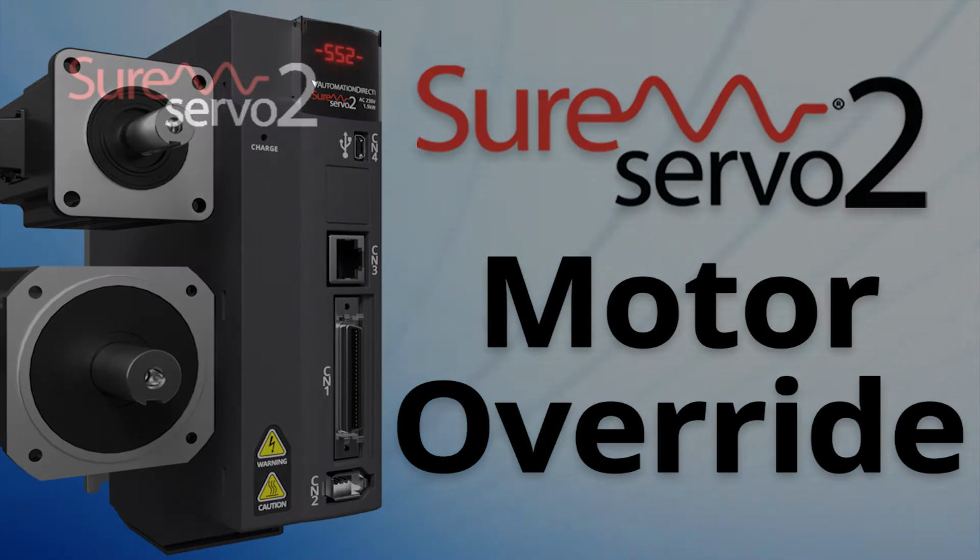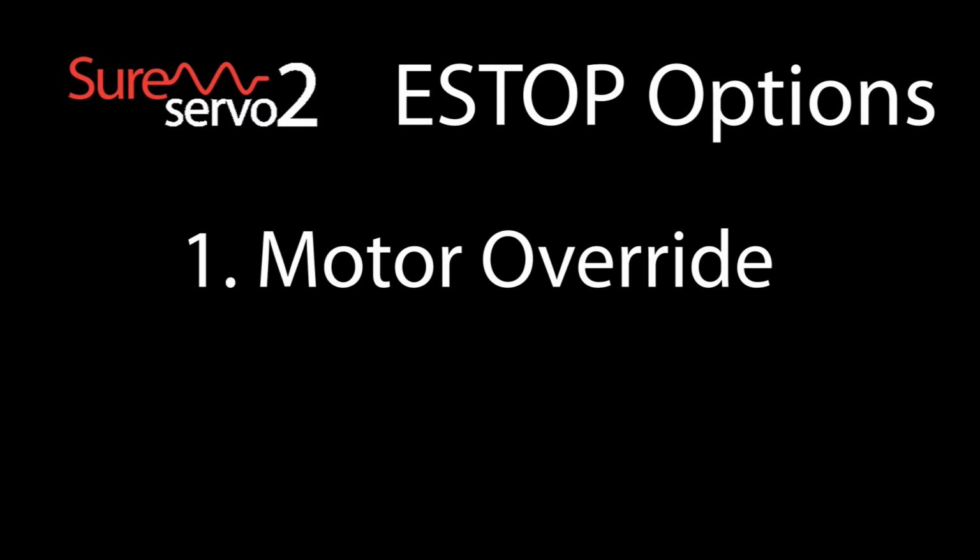The SureServo2 system gives you two ways to quickly stop the motor. You can use a single digital input to tell the drive to override its motor control and ramp down the motor, which would be appropriate for your home shop or other applications that don't need to adhere to stringent safety requirements. Think of it as a poor man's quick and dirty but non-compliant ESTOP button.